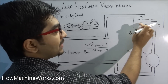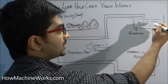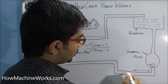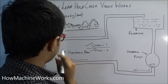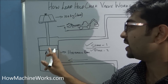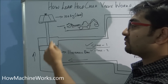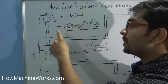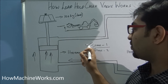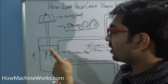This is the reservoir or the hydraulic tank where we have the hydraulic oil. This is our hydraulic pump. When we are lifting the bucket, the hydraulic pump takes the flow from here — you can see the flow goes from the hydraulic pump through this hose and it goes to the hydraulic ram. The flow hits the hydraulic ram pistons and results in it moving upwards. We say 100 kg over here on the hydraulic ram, considering the bucket. We stop it over here — that is stage 1 — and then we try to lift it further to stage 2.